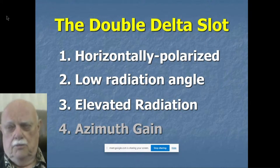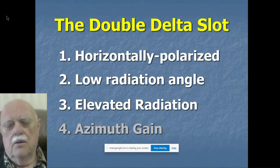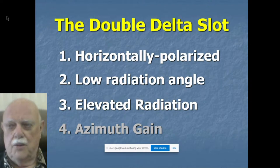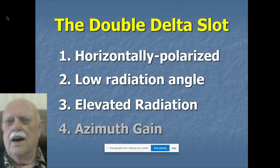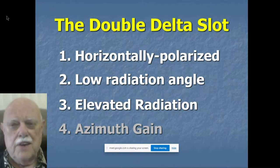It is a vertical, and hams like verticals for many reasons. Low radiation angle, primarily. They have a low takeoff angle. But they have some disadvantages. But here is a vertical that is horizontally polarized. Why is that good? It gets rid of that bad noise that people hate in verticals. And it's still, as a vertical, a low angle radiator. But because of the current cancellation, all of the radiation comes from the top of this antenna.